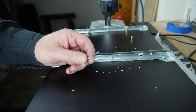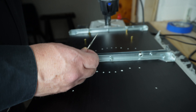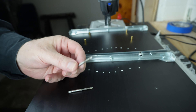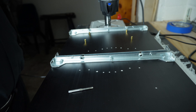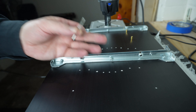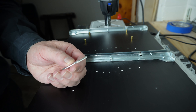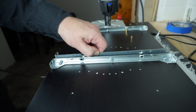Over time, tiny microscopic particles of aluminium get stuck in between the teeth — the detergent lubricant tends to bind them all together. You can clean most out with a brush, but magnification really helps you see what's going on. You probably don't need a microscope, but some sort of magnification is important. As mentioned, use the tapered tap to get started and the bottoming tap to finish off — this tap is basically worn out after doing this job, so I'd recommend getting two and treating them as disposable.